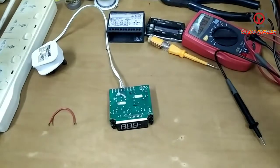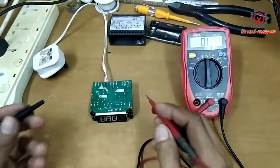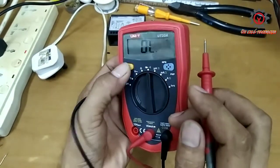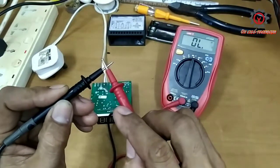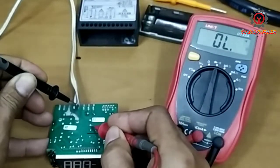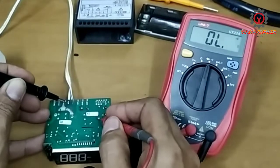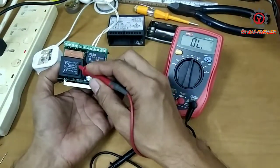While waiting for the soldering iron to get hot, I'm going to show you guys by using continuity. I set my multimeter to buzzer mode. This is our neutral, and this is the neutral of the transformer — it has continuity. But the live wire side of the transformer doesn't have continuity, so therefore the PCB printed trace from the upper part is burned out.